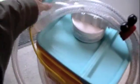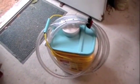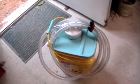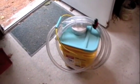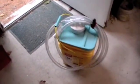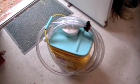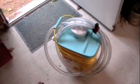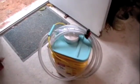You can lift it up and carry it away. They do make filters that you can put down the well, but once things go bad I'm not going to want to pull the pump up and down out of the well just to change the filter. I'd rather do it this way. They do make long filter elements that go right on the end of your foot valve, way down in the well, if you care to try that.